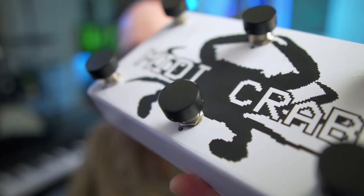The only other physical thing to mention are these optional pedal toppers. Since I don't usually have shoes on in my house I like to use them for any pedals used inside. These ones are aluminum and I got a set of six for about $13 — I'll put a link to the ones I bought. These are the only ones I could find on Amazon small enough to fit on these momentary switches. Most guitar pedal switches are a 10mm head, but these are only 8.5mm and a little more unusual, so there's only one kind that I could find that works — but they weren't too expensive and they're aluminum and black, so they're nice.